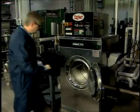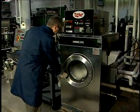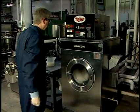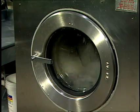First, rotary drum machines. Rotary drum machines are versatile and accommodate a wide range of fabric types and chemical processes, so they're often used for a variety of wet processes.